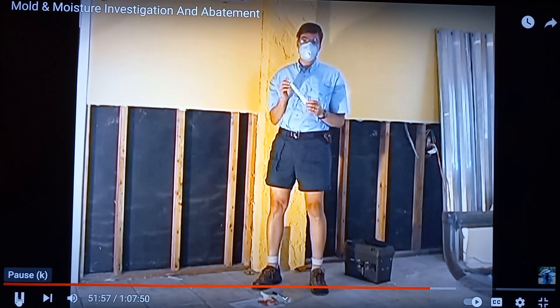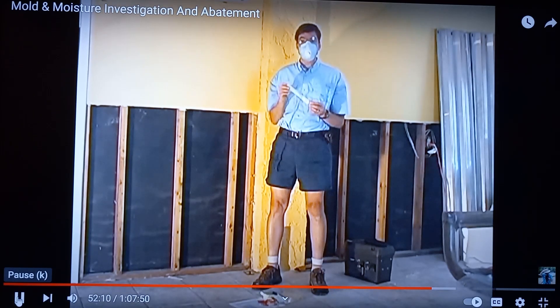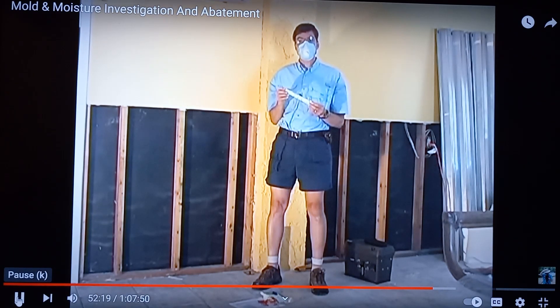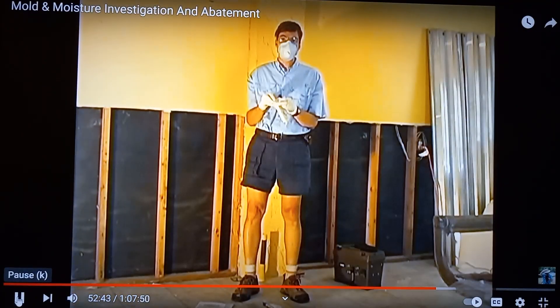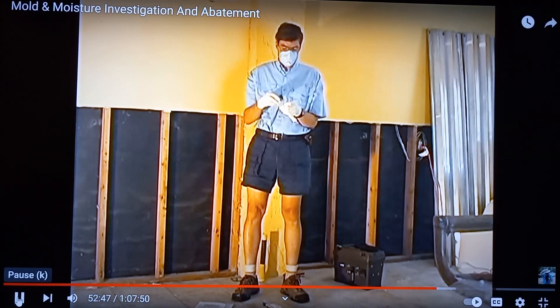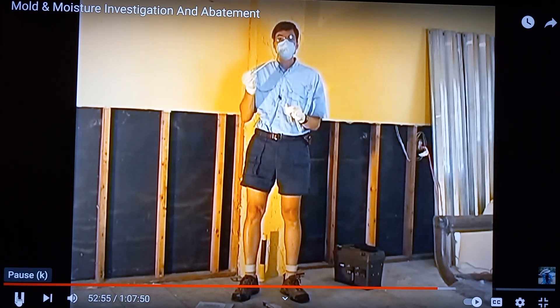The first surface sampling method is to use a wetted swab to roll over the suspect mold growth, collect some of it, and send it to a laboratory. Most labs will provide wetted swabs at minimal or no charge. It's important before you start sampling to identify the laboratory you'll be sending the sample to and check their specific requirements for samples, shipping, and chain of custody. When you open the wetted swab, you want to handle it aseptically — in other words, you want to prevent cross-contamination. The part of the swab that contacts the surfaces should not touch anything else or yourself.